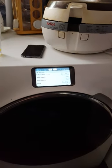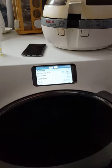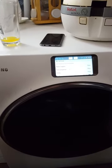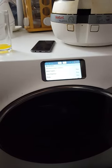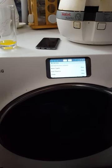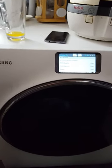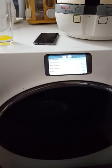One thing you need to be aware of is the height of your waste pipe. I plumbed in the washing machine and the dishwasher myself and had to put in a couple of extra wall sockets. Both these machines need to be on independent wall sockets — they can't be on double wall sockets. Each machine has to have its own single independent socket.